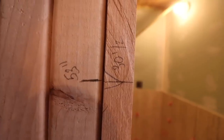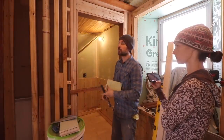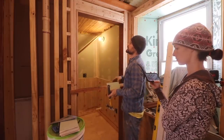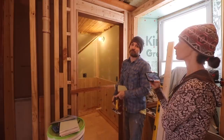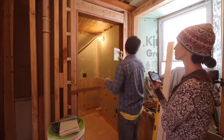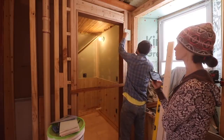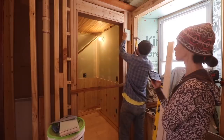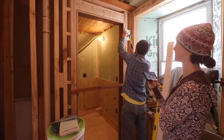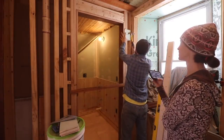That's probably good enough. The next step is you have to kind of take into account your finished wall here. And for me, I'm going to sheetrock this with 1/2-inch sheetrock. So you just get some offcuts of 1/2-inch sheetrock, and you put it up like this. And if you're a baller, like Tom Silva, you use a screw, but then you use a hammer. And it worked. That's exactly what he did.